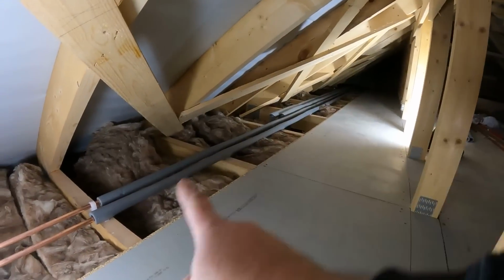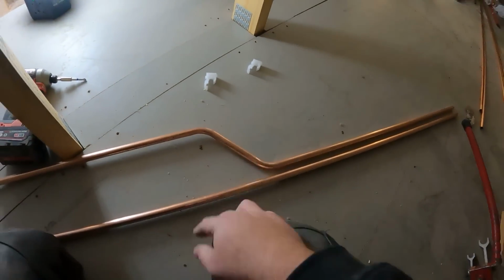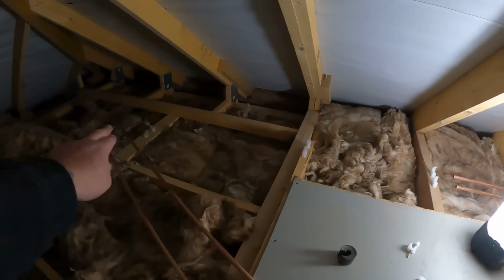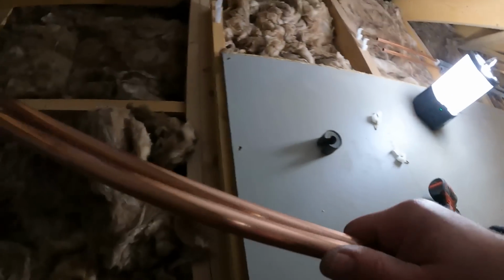With all that lag down there now, we're now up to this point here. And as you can see, the floor drops down ever so slightly there. So, just put a little kick on that pipe there. We'll put another one on this 15mm there, and then we can just come along, drop down across, and then it's gonna drop in that corner over there. We've got the two pipes now with the two little kicks on them, and let's try and get them into position.